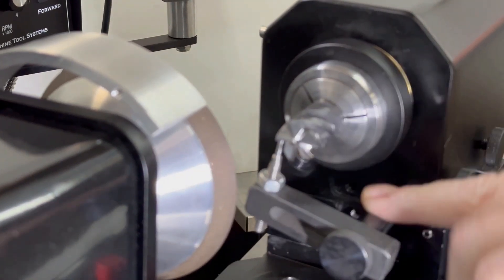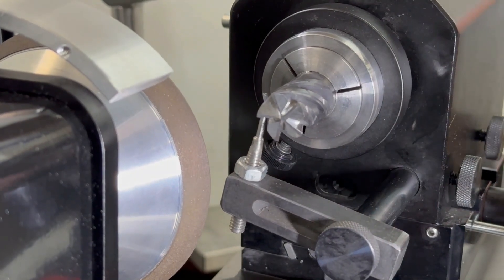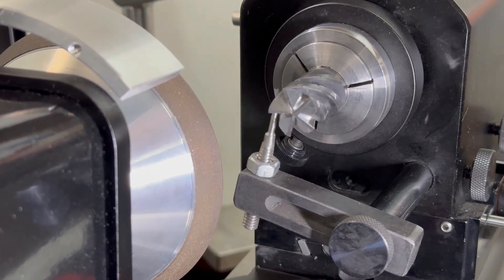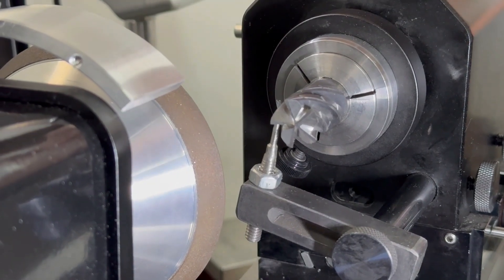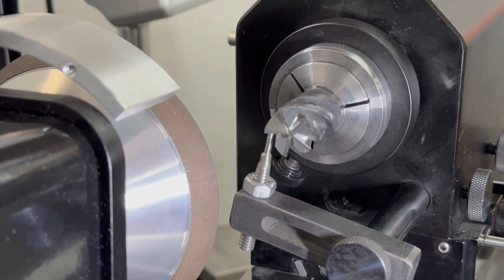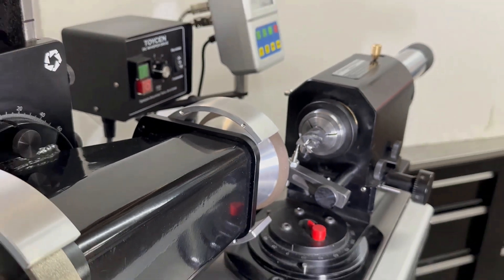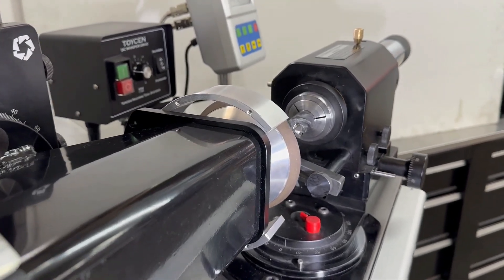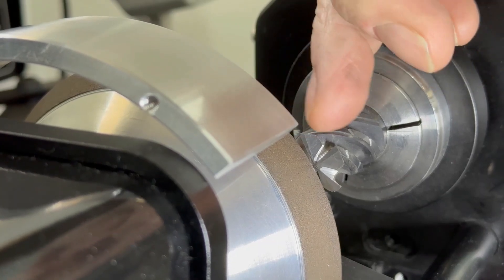What we've done is we've set up the tool rest here. This bar has a flat on it. We flip the bar around so that we can get some angularity to the setup. We've aligned everything so that we can approach it with this wheel. What you want to do is set your height so that you're coming in below center, coming across the tool without destroying that tooth — which is the next tooth up vertically because it's not at 90 degrees. You've got to be able to get past center.